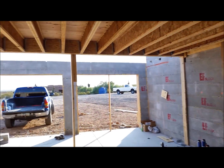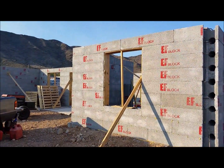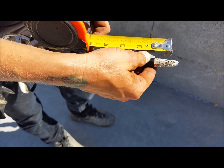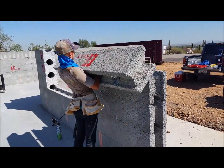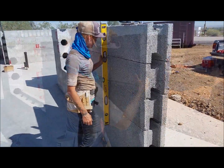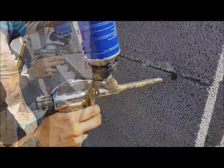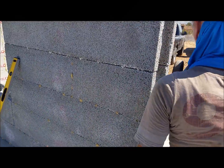Here's a little trick: come back an inch and an eighth and put a piece of tape on your gun so you know exactly how far to stick it into the wall to glue it. Set a block right here — set that inside edge on there, flip it over, make sure it's plumb. Push that gun in and spot-glue about every eight to ten inches. Then get a piece of scrap so we don't have to come back later and rasp it off. She'll go outside and glue the outside — it's that simple.